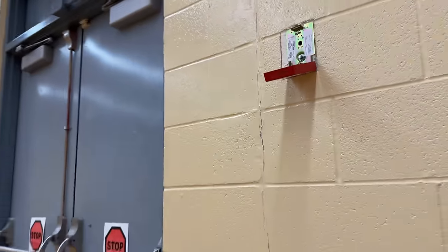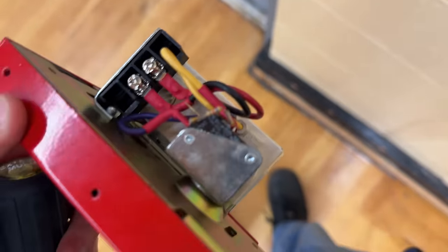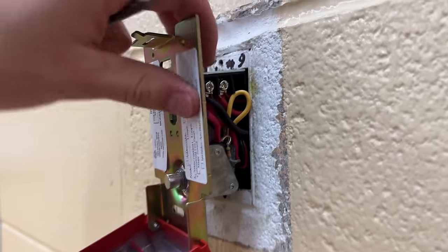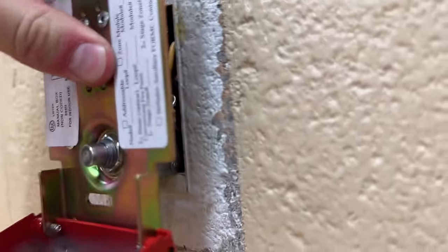This one's open — won't it alarm if I open it? I don't think so. Now we know. How is it open if it works? Maybe one of the wires came off when I pushed it back in. I've just replaced that pull station because we had an open on this one — a little resistor got broken off. The problem is how tight it fits in this box here — that's why the resistor gets broken off.